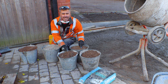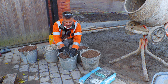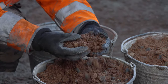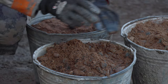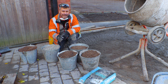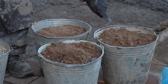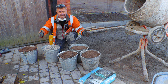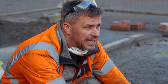Alternatively, you can buy something called ballast, which is what's in these three tubs here. When you look closely it's got large pebbles — like gravel — some 20 to 22 millimetres, right the way down to six and ten millimetre small ones, and it's also got the sharp sand already mixed in. So this is called ballast. If you're doing a very large area and buying it in ton bags, you're probably better off buying ballast — then all you need is four of those to one cement for a really good strong mix. However, for house foundations that are wider and deeper, it can be a little bit weaker, so you would use six tubs of ballast to one tub of cement.